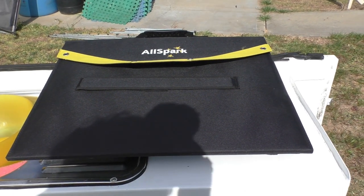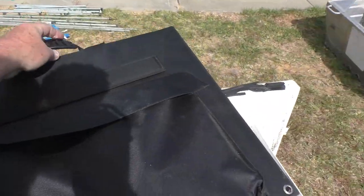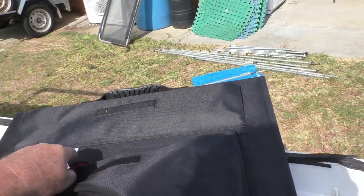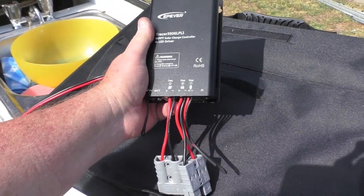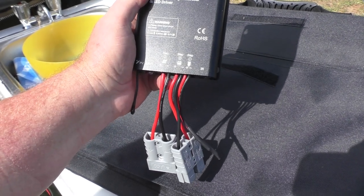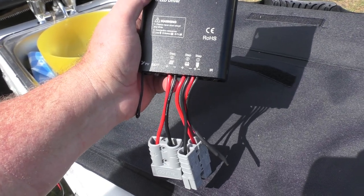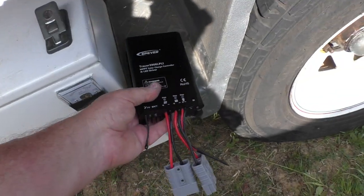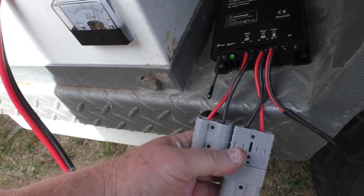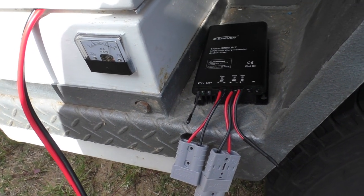And here are the panels - easy to set things up. Just flip that over, cable in the pouch, and I've got the inverter down in here as well. So all I have to do is hook it together. It gives you the order of installation: initially the load if you've got a load running off it, then the battery, and then lastly the panel. We'll just hook that up to the battery. Once the battery's hooked in, you get a green light come on. Now the battery's fully charged at the moment so we're not going to see any indication of charging. But now I'll just go and set the panels up and we'll plug that in.